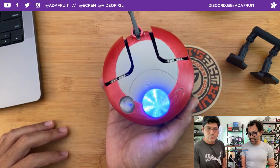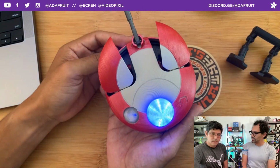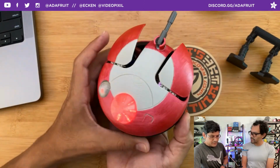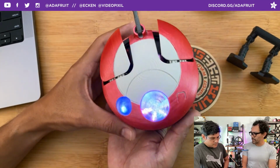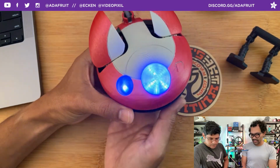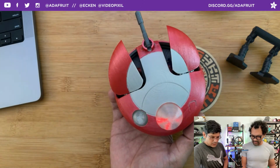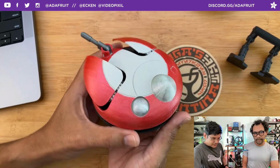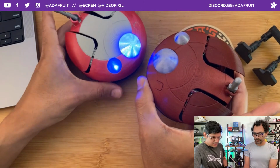It's just the magic of being able to rearrange your components into a completely different body. So big ups to that, and we edited the CircuitPython code. All we had to do was adjust the rotation and the colors for the LEDs, and it was good to go. Just add some control in there. Yeah, update the pins. Instead of the Bluetooth nRF52840 for the Itsy Bitsy, we're just using the regular Itsy Bitsy, with no wireless communication. Yes, and it should be in stock. So it just kind of autonomously does its thing. It's randomized for the movements and the NeoPixel animation.